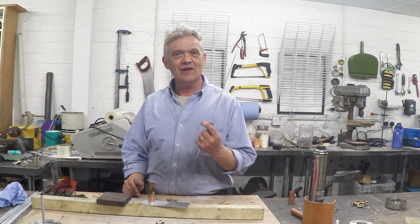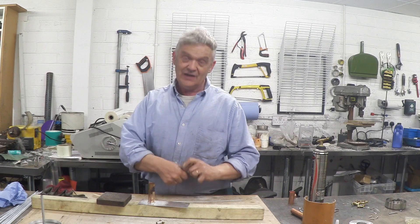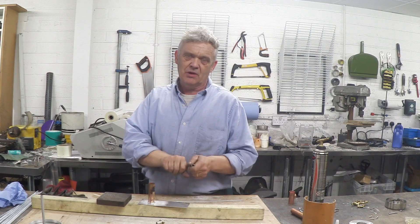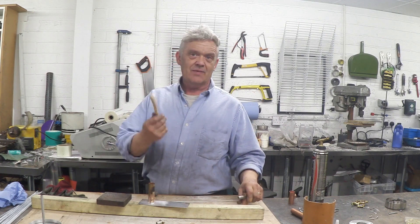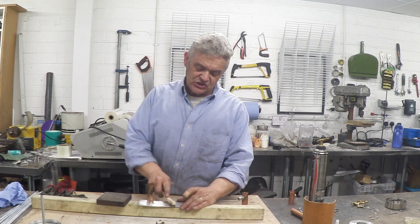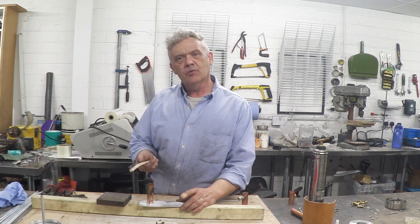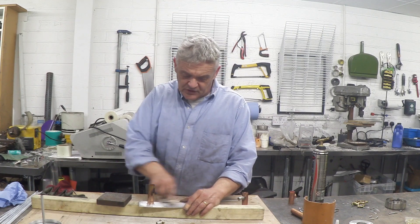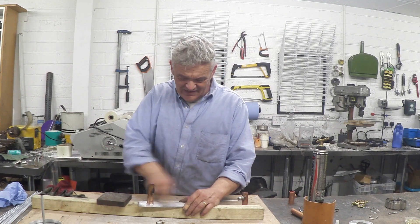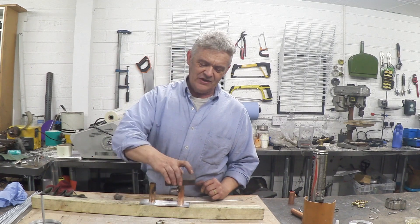What a find — this thing will actually do that job. It wasn't too difficult. All I really did was clean the copper like you're supposed to before you solder it anyway — a bit of wire wool. With this stuff they recommend stainless steel to clean the alloy surface, but I've used aluminium oxide paper and found that works just as well. Give it a good old clean, then stick one on top of the other and put a weight on it.